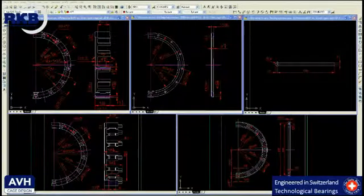Because of the inertia forces, frictional contact, and strain, cages are subjected to mechanical stress and chemical action of certain lubricants or additives. For this reason, the design and materials are the key elements to the performance of bearings.